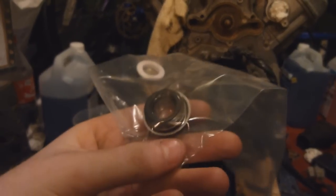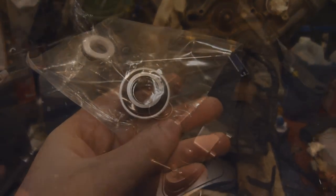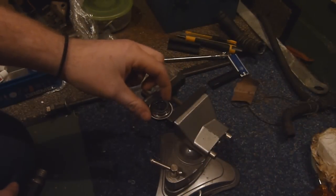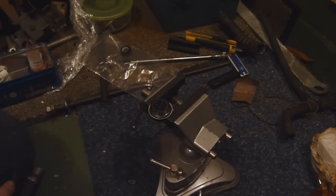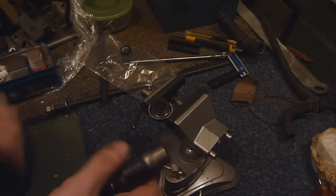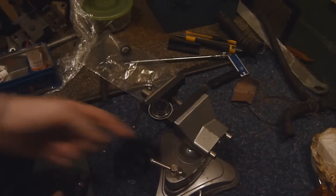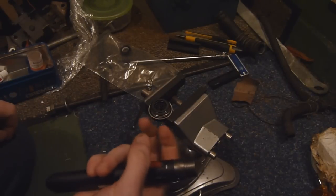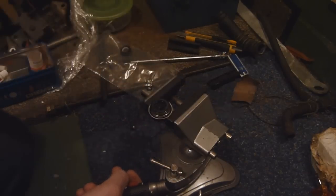It's quite easy. This is the first time I've ever done this and I can only do one take, so this should be fun. This is my setup — I've got my mechanical seal in the vise, which is just holding the cup. I'm not going to be using the cup so it doesn't matter if it distorts slightly, as I'm just pulling the innards out. Using this blowtorch on the lighter setting, I'm going to heat up the bottom of this cup, which should heat up the glue, release its hold on the innards, and it should just pop out.